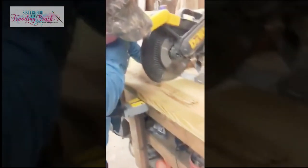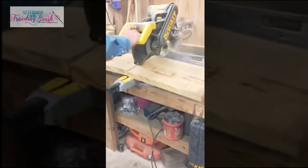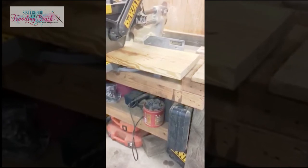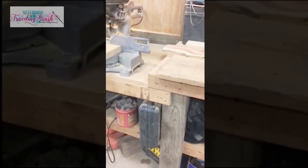When you're making the marks for your cut, you don't just do a straight line — you do little pointy marks so it's easier to draw your straight line across them. This saw has some type of laser guide across there, and he has eye protection on. A lot of times we'll screw what's called a stop — a jig — down into the saw table, and then when you're doing the same continuous measurement over and over, it stops the board for you so you don't have to keep measuring each piece.